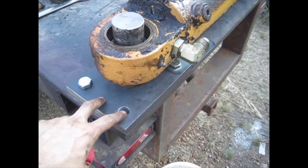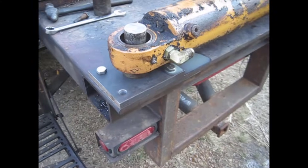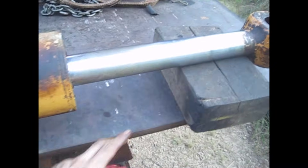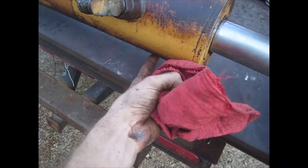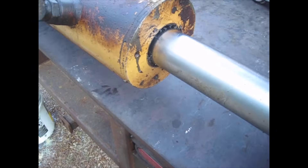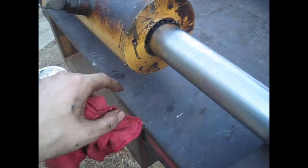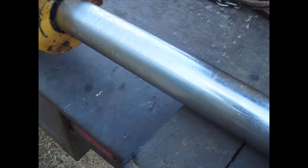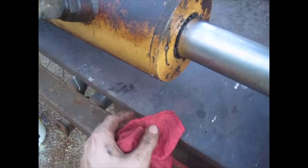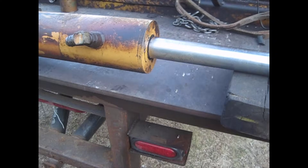You may be asking why I don't have all the bolts in here — I've got two missing. I thought I had four but I didn't. Down here, I think this block is a little tall and it really needs to be up under the barrel, so I need to find a 2x6 or something to slide under there. Also, when we go to torquing on this, we're going to have to put a clamp right here — maybe another block on top — so the barrel doesn't try to slide off to the side. I haven't had that problem before, but on a big cylinder you usually do.